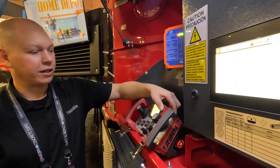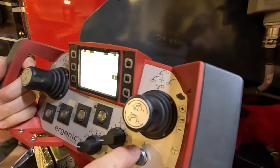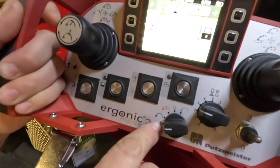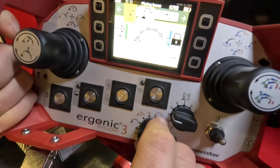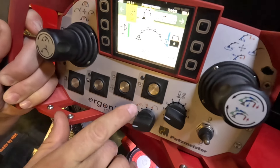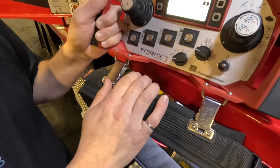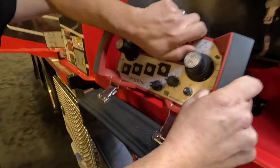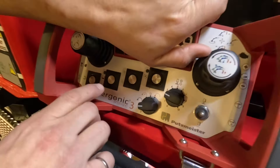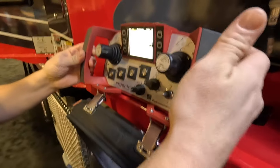The big advantage of the remote control: they've brought back the pump switch — off and reverse. We still have our volume control dial, and the function selector now only uses three positions on this truck. EBC is available on 63-meter units for auto fold, auto unfold, and prime position. For non-EBC units you don't have to skip through a bunch of positions, and you can turn your agitator on and off, and go from snail to rabbit.